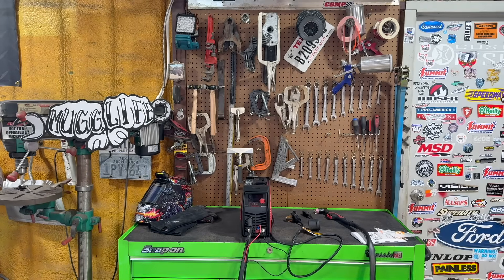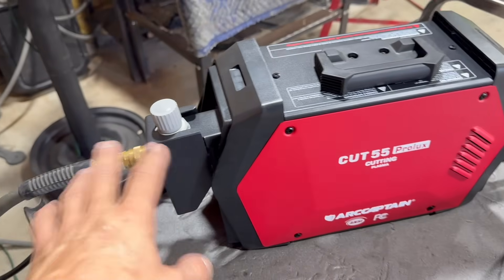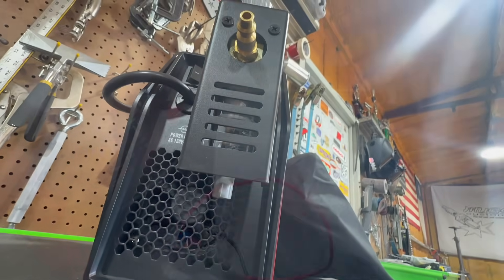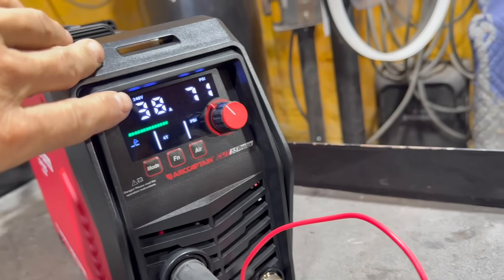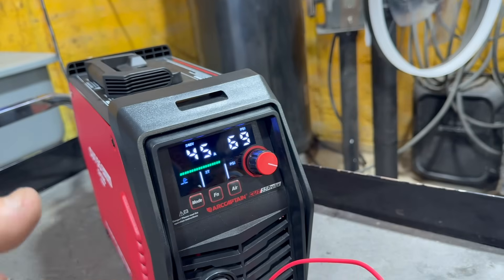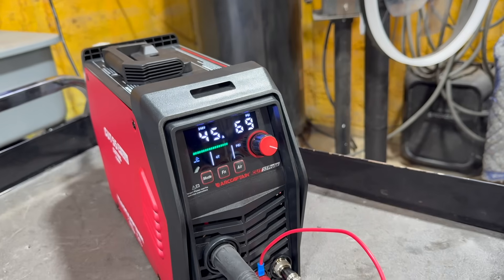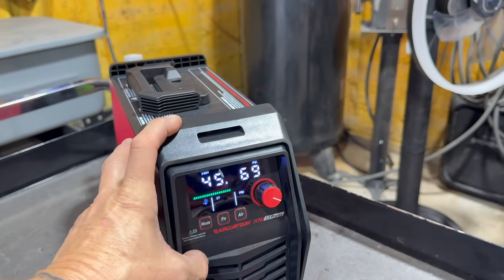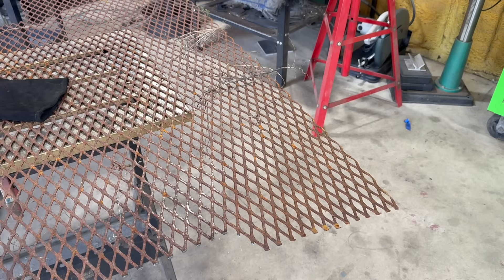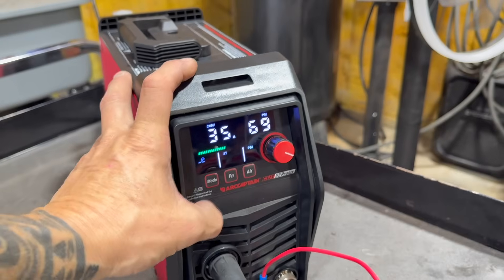I've got this plugged in and set up with air. Let's talk about the air filters and water separator — the regulator is all-encompassing, you don't have to worry about whether the airline is clean. The cooling fan just came on. Clean display — that's 240 volt — and it's showing 71 pounds of air. I usually run around 45 PSI. Click and hold it, it cuts and releases when you stop. Or if you're doing long pulls, you can click it and it'll run until you're done so you're not wearing out your finger. There's also a setting for expanded metal or interrupted cuts, and another setting that cleans off rust.